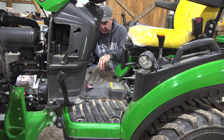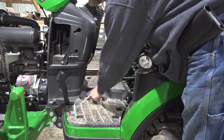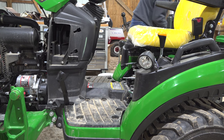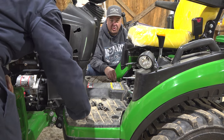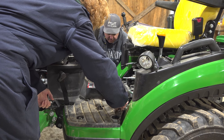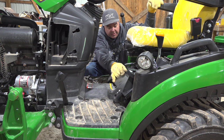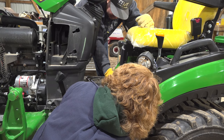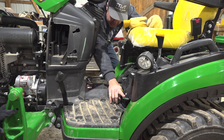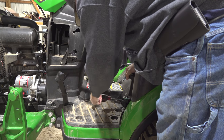It's time for the rubber mats. The rubber mat goes in here on this side, and the front cover was underneath. On my side, I have to bend the fender in a little bit to make the holes line up. This piece is identical to the 2014 — or at least it goes on exactly the same way. What Christy did there that you might not have been able to see clearly was pull down the differential lock lever to be able to get this piece of plastic on. Just by holding that lever down, it goes in fine.